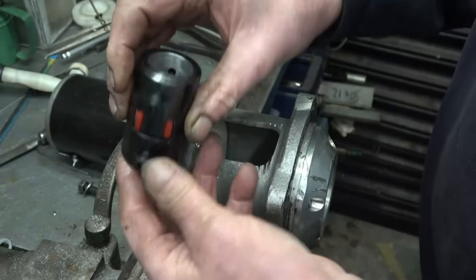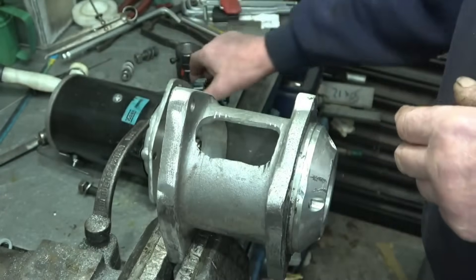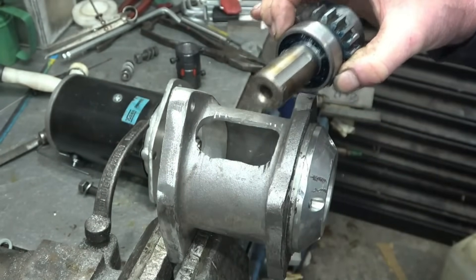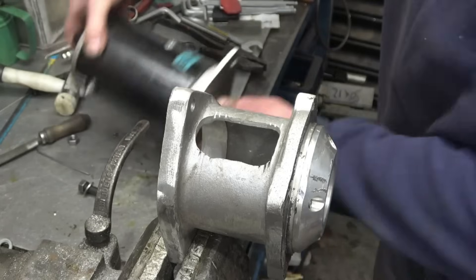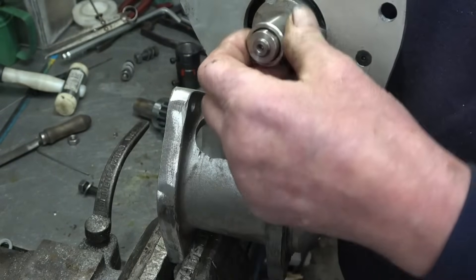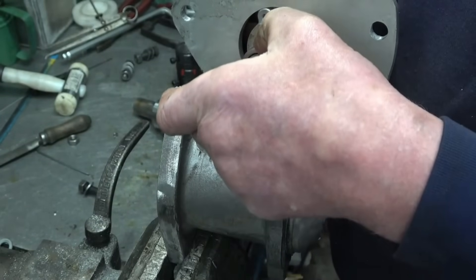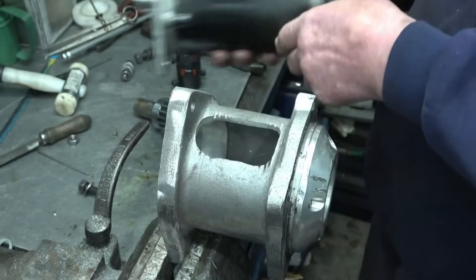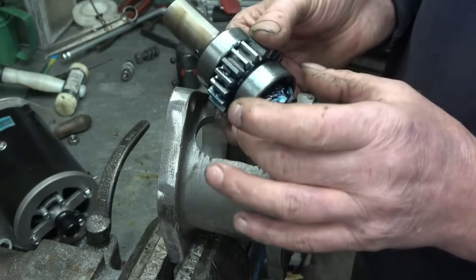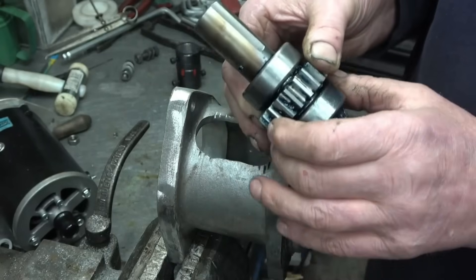I've also machined the coupling ready to fit. I put a clamping screw in each side, and there's a flat on each side of the shaft — I'm fairly certain that'll be good enough to hold that. On the dynamo side I made a barrel nut, tightened that in, so that's now tightened in there with a key in so it can't go anywhere. Once again, two flats machined on there. This bearing is actually supplied with oil — I'm not sure what's meant to go on with it, so I've put some real high-quality bearing grease into it.